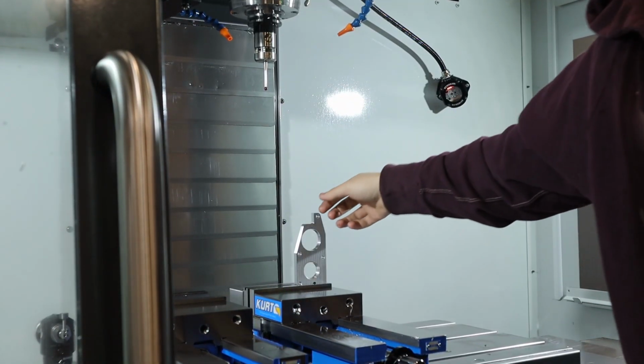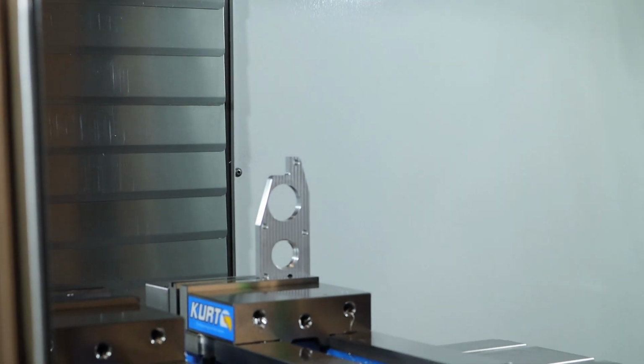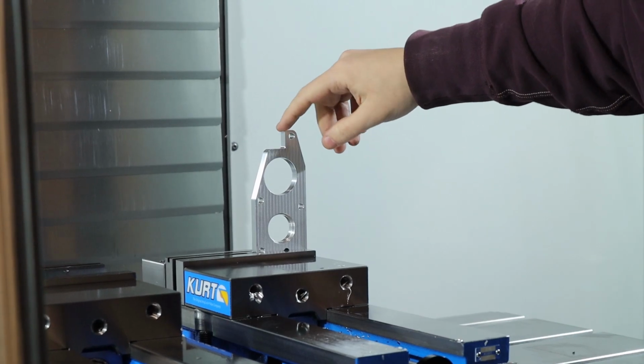Cool, so remember we're going to indicate up on this peak basically. There he goes. This guy right here, right in the middle. Okay, then we're going to handle jog over and down to do our X, which is going to be, I think, in the positive direction. So again, single surface, do X, and we'll do 0.2. Then get our Y, which is the middle of that thing.